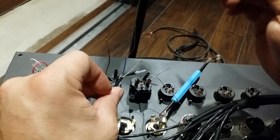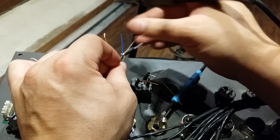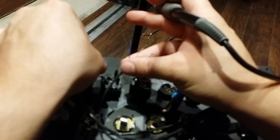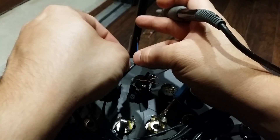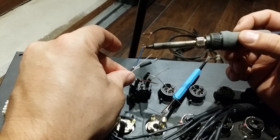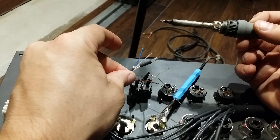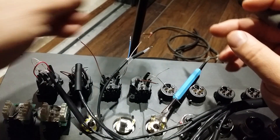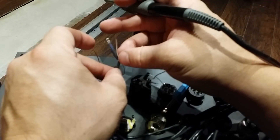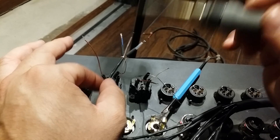The hot on the snake side is going to go to the tip, right here. Same thing here. These jumper cables are a little longer than the slack I have in the snake, so sometimes you have to kind of bend the cables around and convince them of what you're trying to do. Since they're tinned, there's already going to be some solder there to melt and hold them together. Once you find your rhythm, it might take a couple tries. I could have really given myself more to work with on the snake end here.